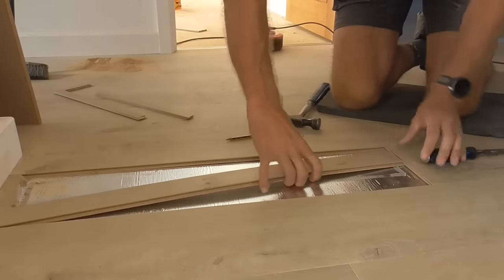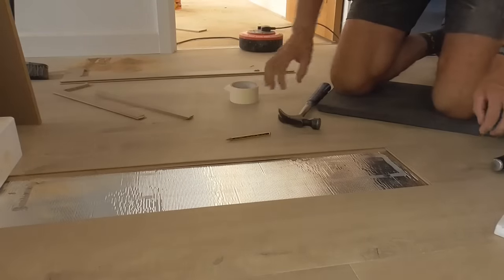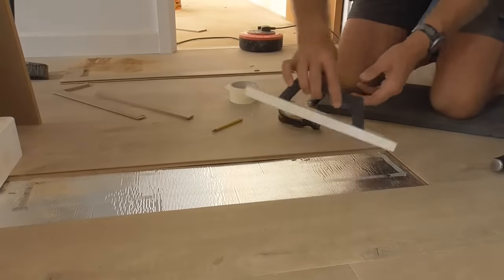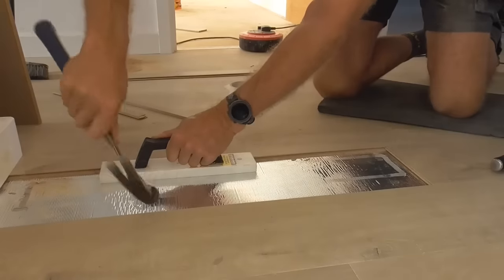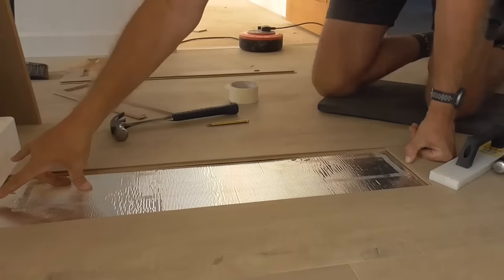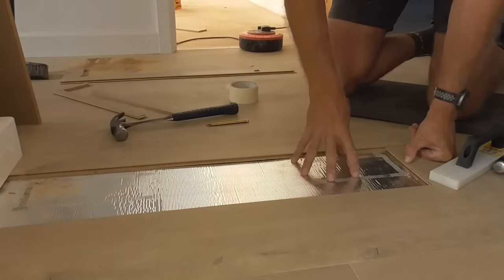So what are we doing here now? Very carefully we've got that bit out. I've got to be super careful here all the time. I'm going to gently tap on this — this is the bigger knocking block because it spreads the load further down the edge of the board. Let's just see if we can knock this one back a bit. Yes, a few mil. Let's now take a measurement from the corner of this board to just underneath that skirting, cut our spare bit of board and see if we can tickle it in there. If we can tickle it in there, we're laughing because then we can just knock it all back flat. Let's get that cut and see if we can get it in.